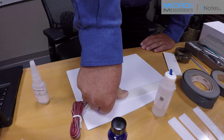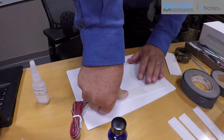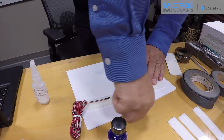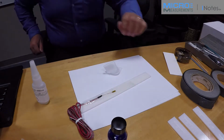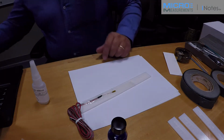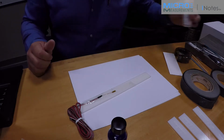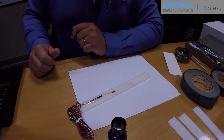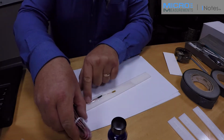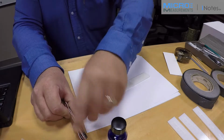Alright, so I've about reached my 1 minute. So in preparation of removing my thumb, I'm going to press down firmly, rotate my thumb 180 degrees. And now typically we'd wait another minute to give that adhesive a complete opportunity to cross-link. In the interest of time saving, I'll get the cable ready to connect to the instrument.